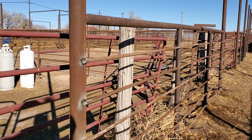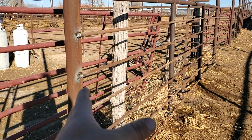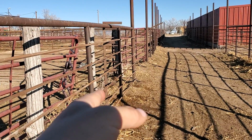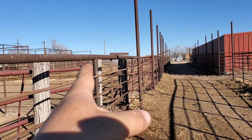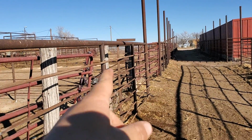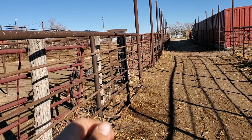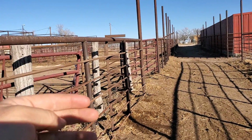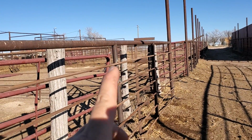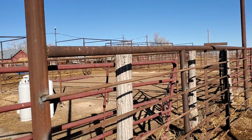Like I said, I'm currently going this route with 2 7/8 pipe, 2 3/8 line posts, and a 2 3/8 top rail. And you do need to run a top rail if you're going to run sucker rod, because there's no structure to sucker rod. All its strength is with the rod, so it has no strength that way. If you don't run a top rail, then those posts can move. So you've got to run a top rail.